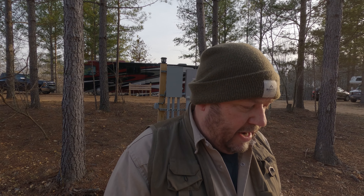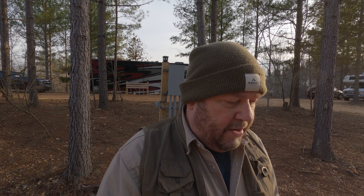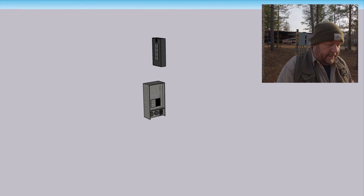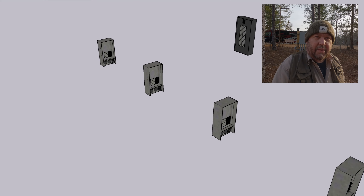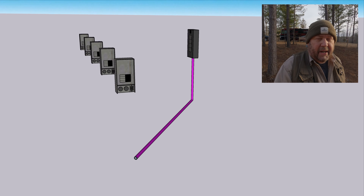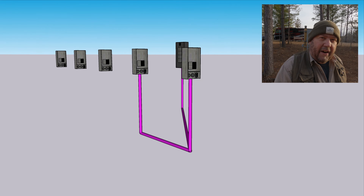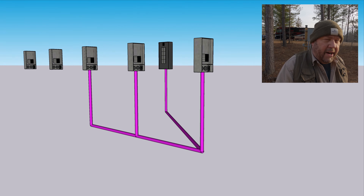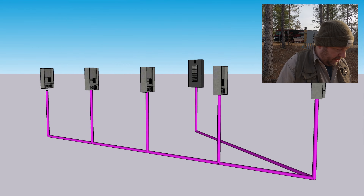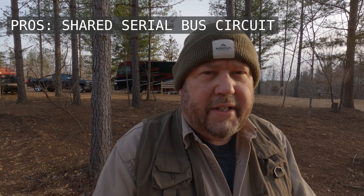The concept is similar where you have one power source for multiple lights, or RV sites in this case. Instead of having a 200 amp distribution panel with individual circuits to each RV site, one circuit on a large 100 amp or 200 amp main breaker starts from that main breaker and runs to the first RV site, comes out of the ground up into the first RV pedestal, then daisy chains on to the next RV site, and the third one, the fourth one, and so on. You can have multiple RV sites on one circuit.